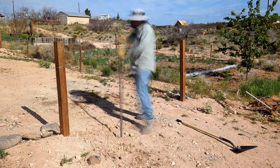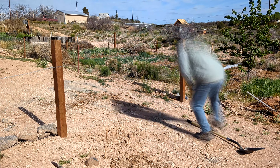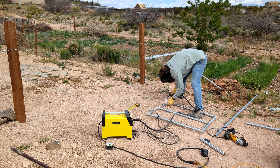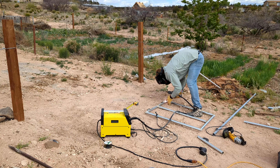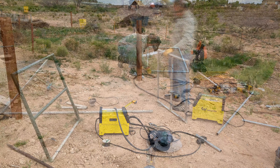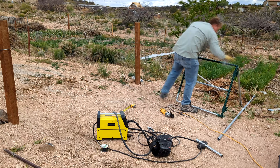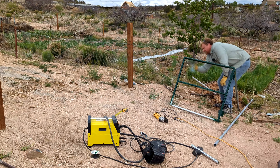I'm going to get these gates in — I need to dig this out just a little bit, because after the gates are mounted I'm gonna dig out a little strip and put two two-by-fours in there as a form. Pretty much the goal of the gates is to block off the two gate openings. This one is going to have a double gate — one that's about six and a half feet long, and then a normal walkthrough gate wide enough for the wheelbarrow and wagon, which we use normally.